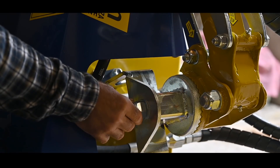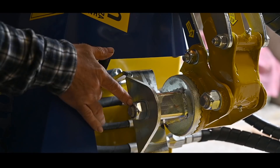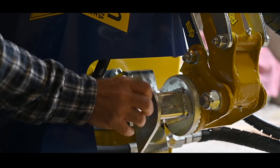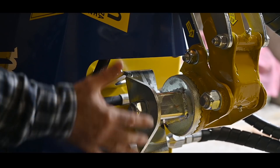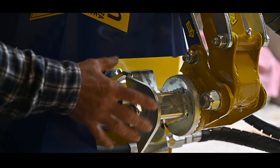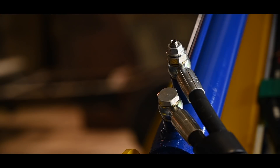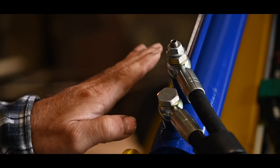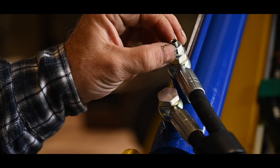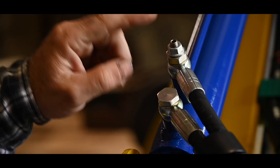This deck is also fitted with an adjustable head — if you need to cut at very weird angles, you undo the big nut, slide it back, rotate it, and lock it back into place. You can also rotate the deck automatically with the hydraulic system but may still need to manually adjust for strange angles. All hydraulic cylinders connected to the frame have greasing nipples. If the pistons move too fast up and down, there's a flow restrictor on top of each cylinder so you can adjust the oil flow rate — a great feature.